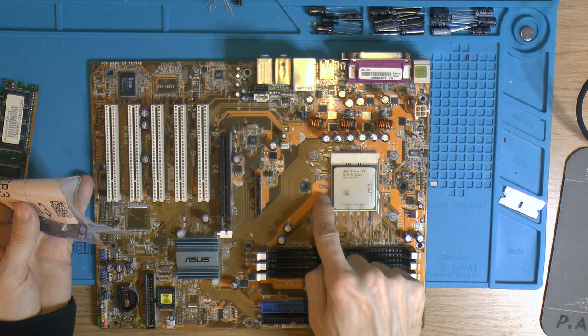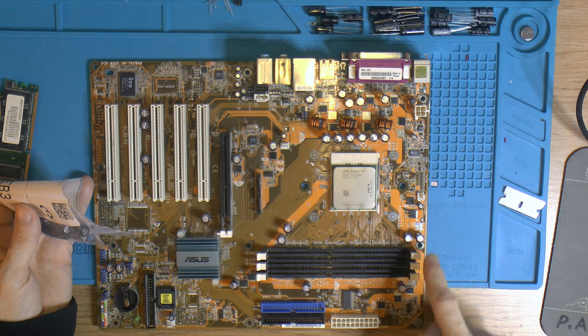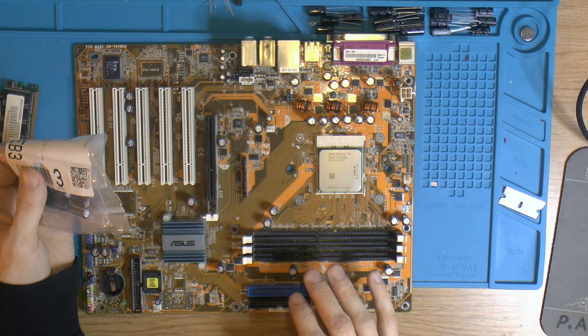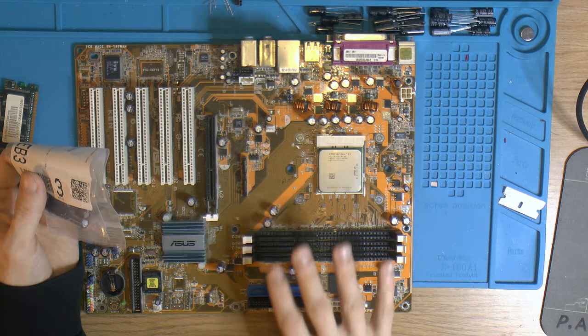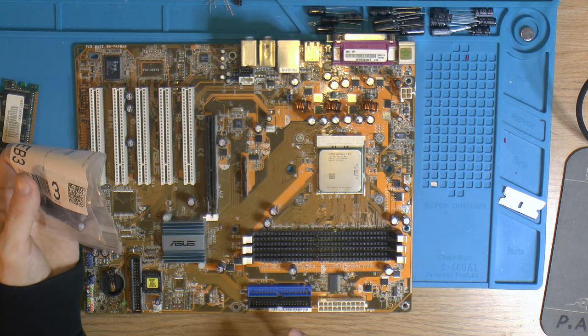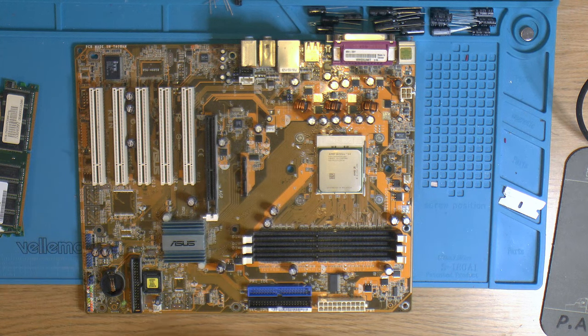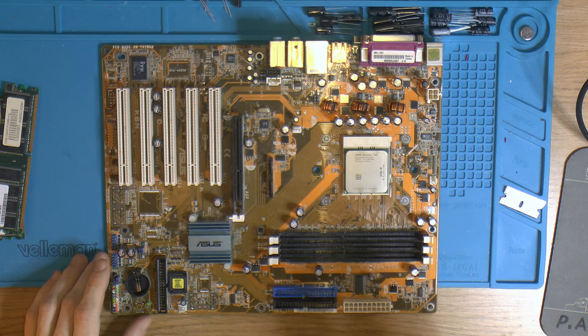Then we've got, obviously, we can see here, the whole trace around here. This is memory. So here I want to use those 10 low ESR Panasonic, where it really matters a lot more to have good caps. It's not just bulk, because we're doing DC-DC conversion switching. So yeah, that's the plan. Recap this, assume it works. Now we're going to test it, see if it works, then we'll recap it, and we can run something on it.